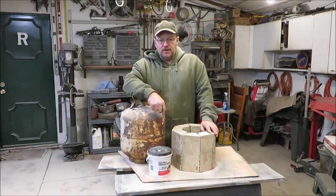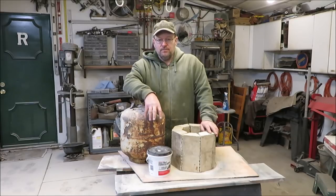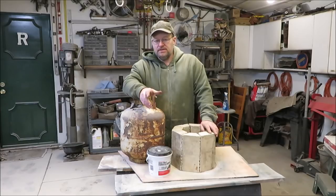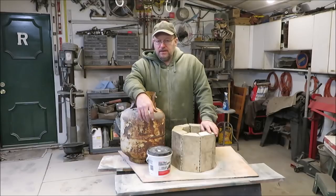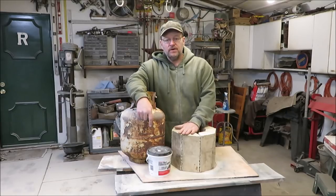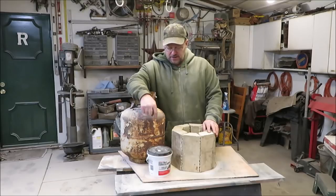You've seen me cut the stone. I think these bricks are going to hold a lot more heat than any of this refractory mortar these guys are using inside their blast furnaces. I would rather use something that I know is going to last for a long time than hurry up, pay a bunch of money, and mix a bunch of chemicals together to make a refractory mortar. These brick are going to serve me well - I'm just going to use the mortar I'm buying here for in the cracks, that's all.